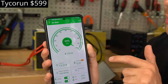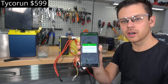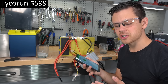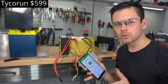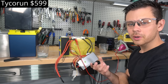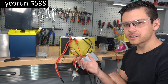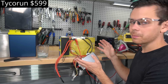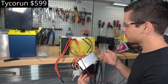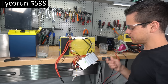The state of charge indicator hasn't been calibrated — it shows 99% but it's probably around 50–60%. It will sync once you hit absorption and high voltage disconnect. Settings are password-protected; you can contact the company to change parameters, but I don't recommend it — leave it for advanced users. Compared to other clone knockoffs, this is pretty good build quality for $599, but you could buy an SOK with the same features and better build quality for the same money.